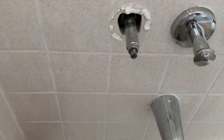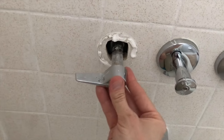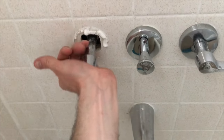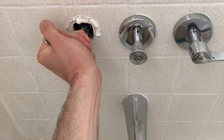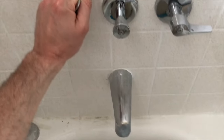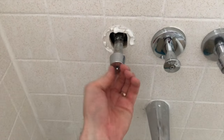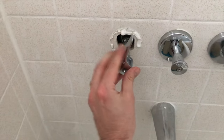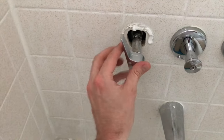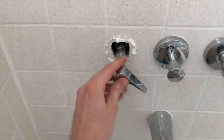From here, I've got the water stopped and all the sinks in the on position. We are going to reconnect the hot handle and carefully turn it to the on position — there might be a little bit of water that comes out, so I'll do it slowly. The full open position is important because it will allow us to remove the stem easier without damaging the seat.